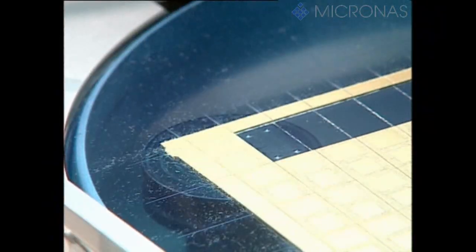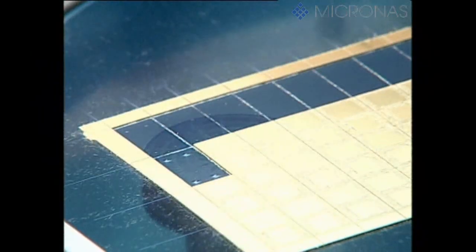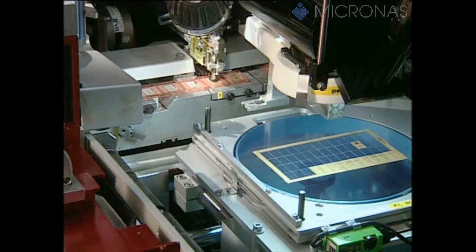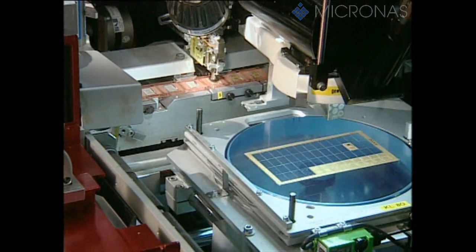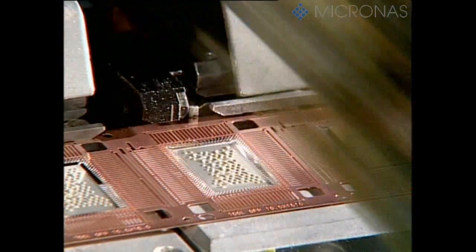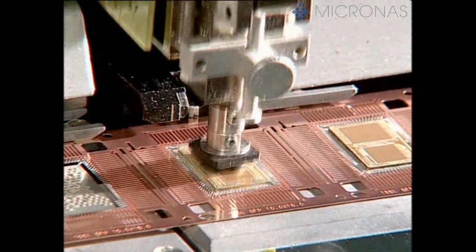The remaining dice, or in this particular case a small printed circuit board, are bonded onto copper strips with an epoxy resin adhesive. These copper strips subsequently form the electric contact with the printed circuit board — they're also known by the technical term of lead frames. The silver conducting adhesive, which is filled with silver particles, is hardened for 45 minutes in a continuous furnace operating at 145 degrees Celsius.